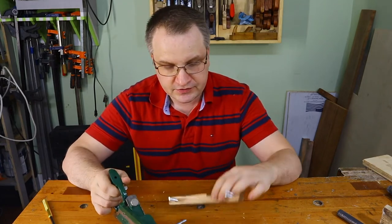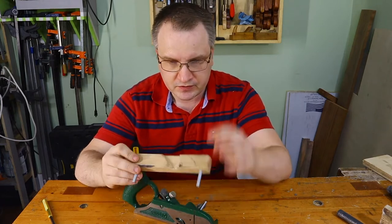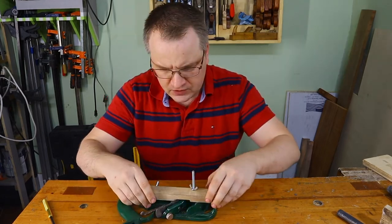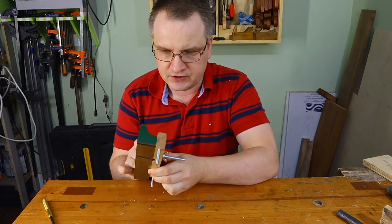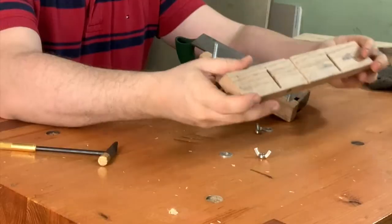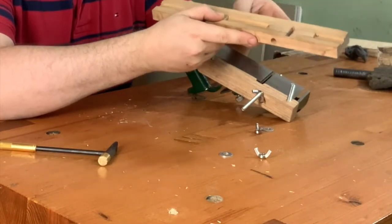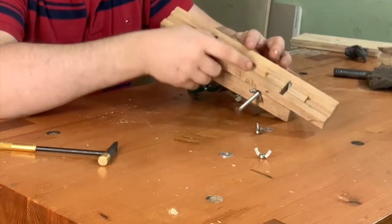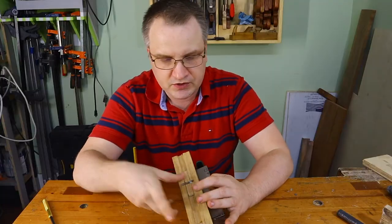After you have this rod and this piece, this is just a drill hole for the carriage bolts - nothing special about them. You can attach this piece to the plane and secure it by hand, so now it's really tied to the plane and really parallel. You don't need to worry about this one. Now you have these two pieces, and then the final piece is the actual fence. What is important here is that this side has to be perpendicular to this side and be very, very straight. The wider you have this part, the more adjustments you can make.